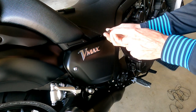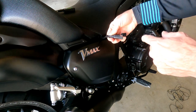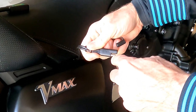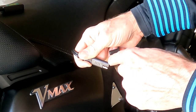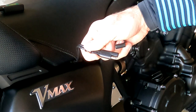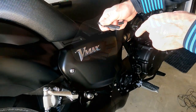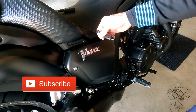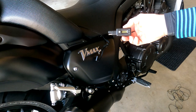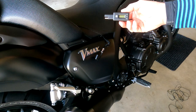You have access to both battery terminals right here on the quick disconnect, so if you have a multimeter you can just put the leads on each one of these connections and measure that way. The exposed connector is the negative and the other one underneath is positive — that's particularly important if you are connecting an older analog meter. Most of today's digital multimeters can account for reverse polarity and won't be damaged if you get the polarity backwards, but it could be harmful to an analog meter. So whether you prefer this voltage indicator or a multimeter, both are options.